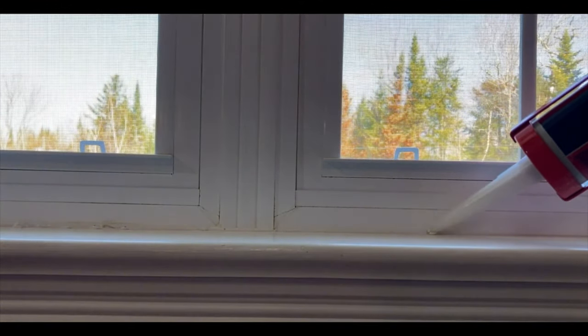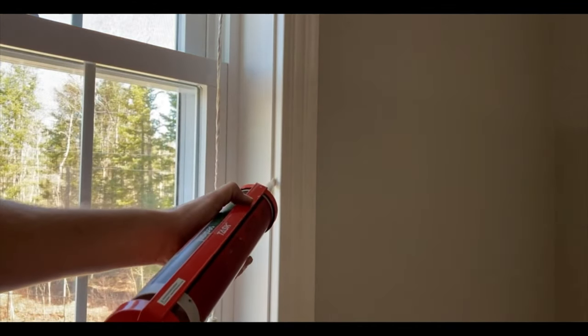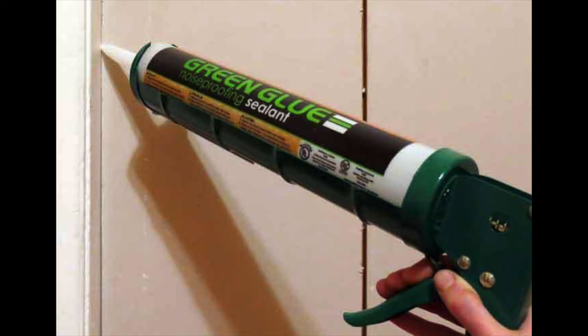The difference between regular caulking and acoustical caulking is — well the price of course — but acoustical caulking will stay rubbery over time. Regular caulking dries up, and as the home shifts it cracks and those cracks will let noise in. You might not think it lets in a lot of noise, but it does. That should be where you start — don't go and remove or change the window without starting with the basics. All you need to buy is some acoustical sealant and a caulking dispenser, and I'll have links in the description below.